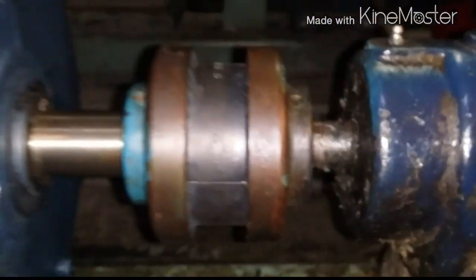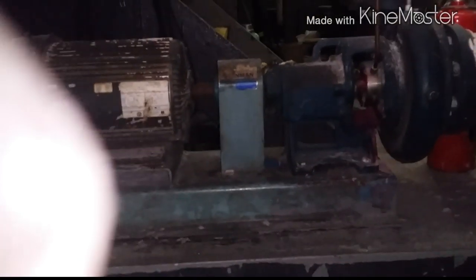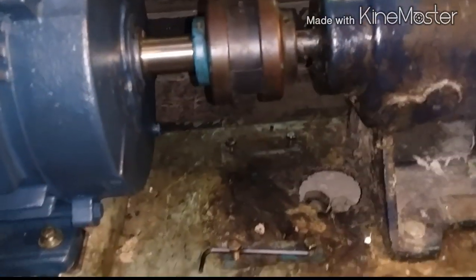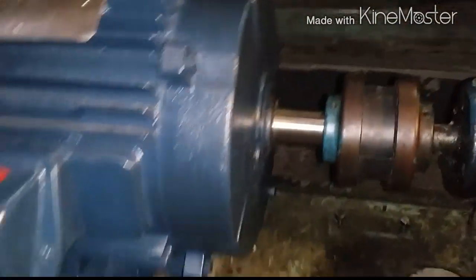I'm leveled there. So the next thing I'm going to do is secure the nuts and Allen keys — I'm going to secure the bolts on this. The last thing you do is secure that protector guard, which you can see on that pump, and that will go right here. And that's it, guys. I just wanted to show you guys how to properly align the pump and install the Lovejoy.